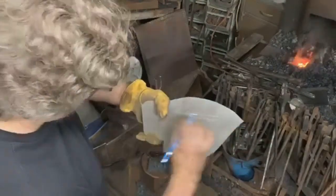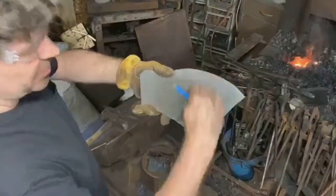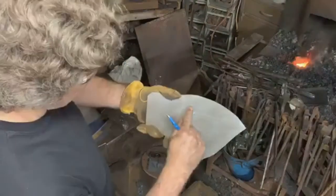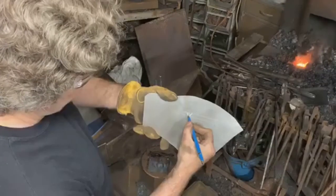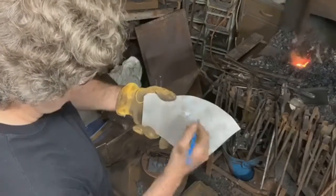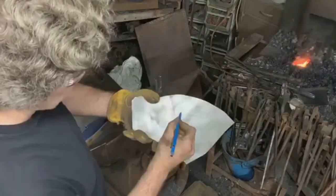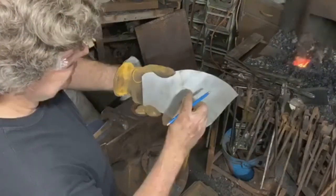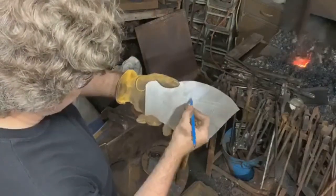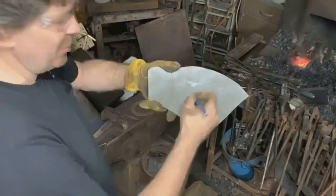But I want this piece — this is my horseshoe — I want this to go flush to the wall. So if I've got a rivet head back here, it won't sit flush. So instead, what I do is make that hole out like that, poke it through, collapse it down so I fill that hole, and then file off anything that's still out there. And now it's done. So this is the blind rivet — it's now flush, and yet it's riveted on. That can't come out. There's no way that's coming out.